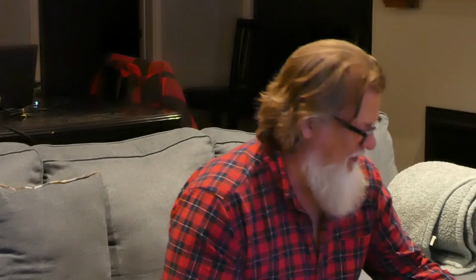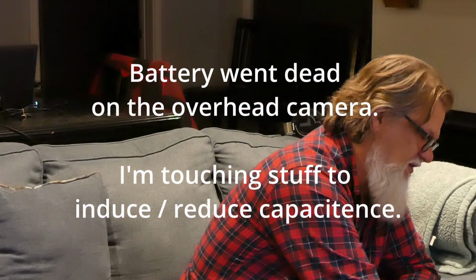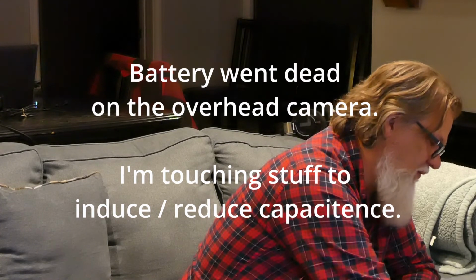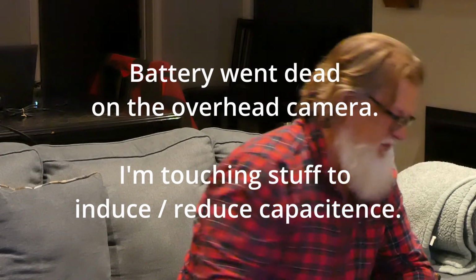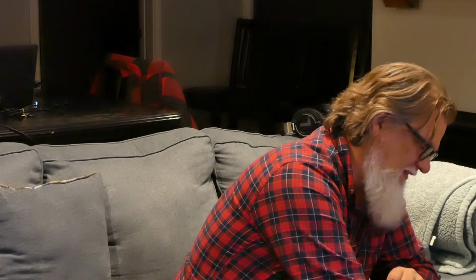Well, I would say that one of the primary problems here is that this thing's built up on a breadboard, and breadboards have a lot of capacitance, and there's a lot of potential for poor connections. That's the lengths of two resistors getting together. I worked on this for a while to get it as clean as it is before I started this video. But sitting around on this breadboard for a few days, you come back to it, and it's pretty squirrely. Connections, these wires get loose.